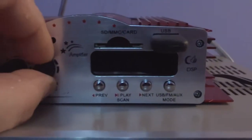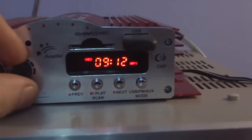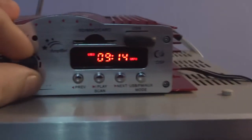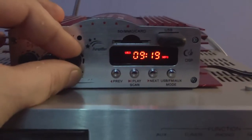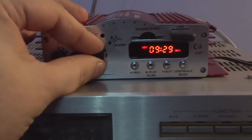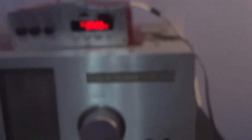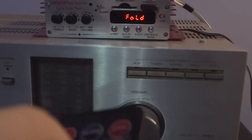There's one thing you've got to be careful of with this: when you switch it on, I can hear DC current going straight through. The speakers won't last long if you keep playing it like that, so you definitely have to change those filter caps.